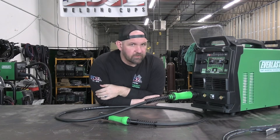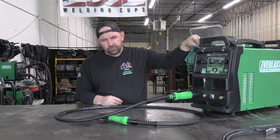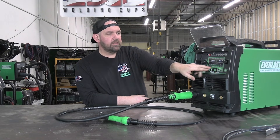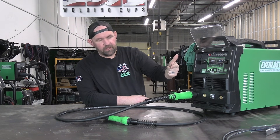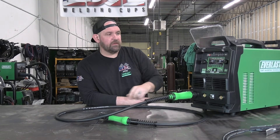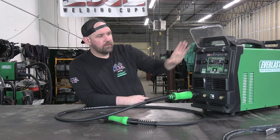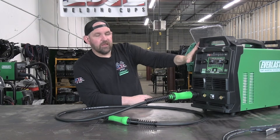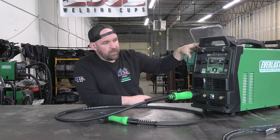It is based on the 262 Cyclone, with a lot of the same menu as our 253 DPI, the Thunder 255. The three signifies that it is a pulse MIG machine — so 263 P for pulse, not DPI for dual pulse. This unit does now have DC lift TIG and synergic single pulse, with power set mode available with our single pulse.